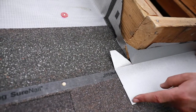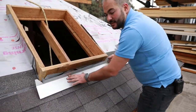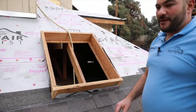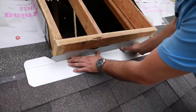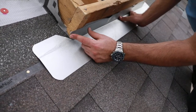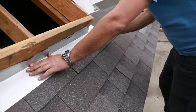Another thing we like to do is round these corners off and bend these in, and we want to do that on both sides. Now for this demonstration, we've got a piece of flashing that's prefabricated. This is the same 110 metal — four inches and two inches — that's pre-cut. You can see here the corners are rounded. All that's left to do is to bend this flashing nice and tight to this corner, and we're going to do the same thing on this side.